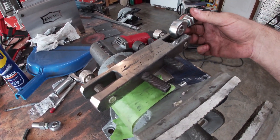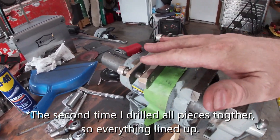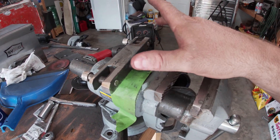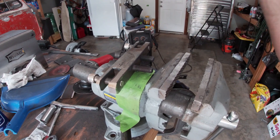That's how I built my heim spreader. The whole point was to make sure my heims can be out to six inches on center. Whatever A-arm kit you have, you can measure your own pivot points and build your own spreader - all I did was take some one inch bar, cut them up, and drill them. The first time I made way too much work for myself; the second time was much faster. What it will do is space my tie rods out so the length will be much closer to the A-arm length, making everything arc in the same radius - therefore helping eliminate bump steer. I'm not saying it'll eliminate it completely, but theoretically it should minimize it. Doing all these things to minimize bump steer hopefully will make a difference. That's all I got for today - please like and subscribe. I'm Damian and this is the Binder Builder.